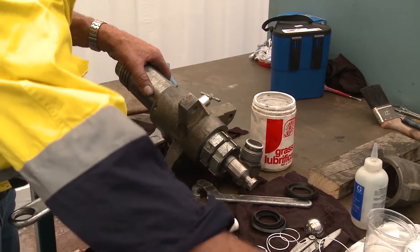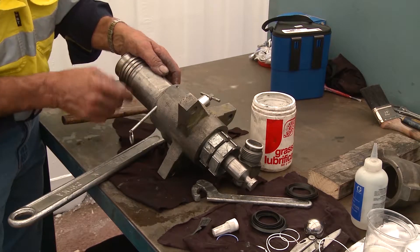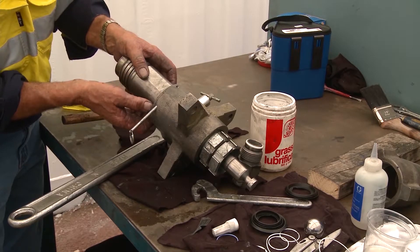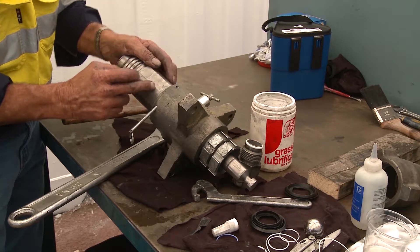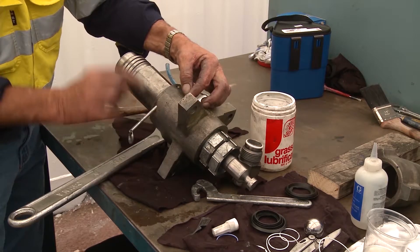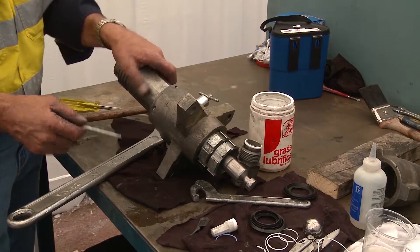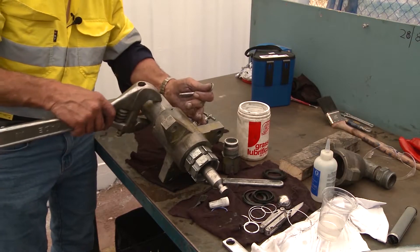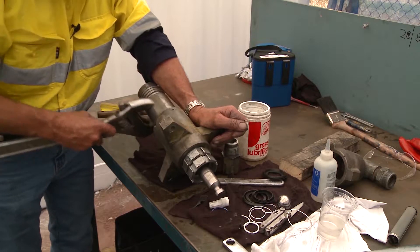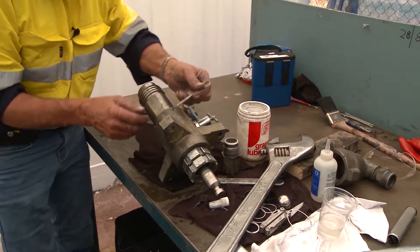Remember there's a pin that has to go through here and marry with the flat section of this single cylinder wall. I need to apply some force until it has sufficient torque to flatten it or bring it back. I can turn this cylinder wall in the housing according to the taper requirement — that seal will seal the cylinder — and I need to get that pin back in, because this pin is the only keeper for the entire cylinder wall. Just adjust it around until the flat section marries with the pin without damaging the thread.